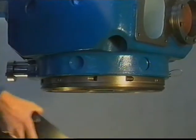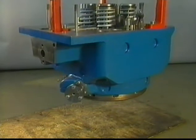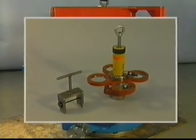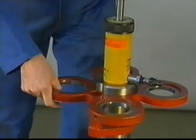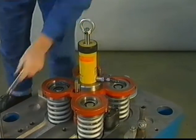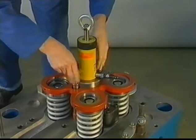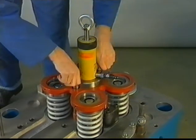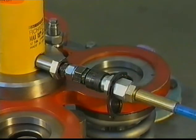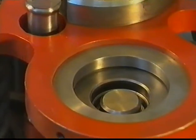Before removal of the valves, the protecting ring has to be removed. Place the cylinder head on a wooden plate. These are the tools to remove the valves. Place the tool on top of the spring discs and place the distance pieces around the injector studs and lock them with the nuts. Use the proper adapter rings. This depends on the valve rotator execution.